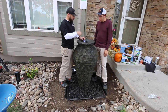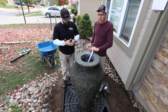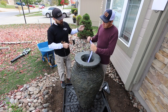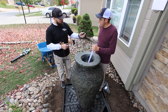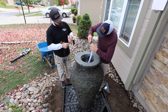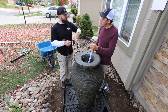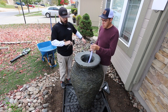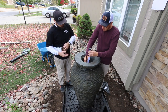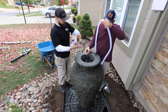We're upgrading — giving you an enhancement. I'm taking this standard fitting out and putting in a light that looks exactly like this. So when this bubbles up and it's churning, it's going to be lit up right on top of it. If you're not installing a light, everything is already set — there's no drilling holes, no putting anything together. It's a one-way street — you go down through the basin. So let's drop on that light, and I'll watch you feed it through, because it's that easy. Just feed the wire through there, and the driver goes right down — keep on feeding it through.